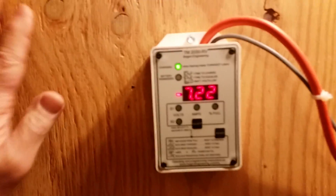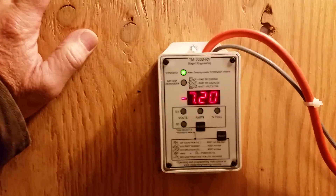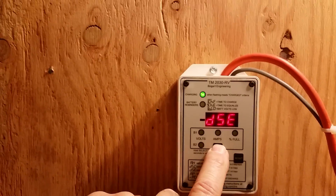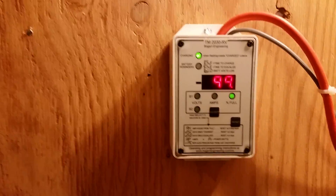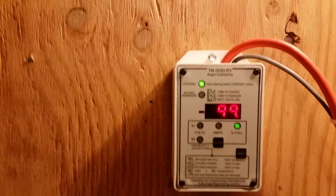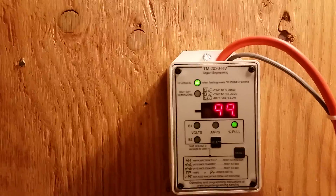So what I've been doing on cloudy days is turning the solar charge controller off, so I don't have this artificial voltage going to that shunt — and it stays in absorb mode longer. Let me show you how much longer. According to my battery monitor I am down minus 7.2 amp hours, so I'm getting very close and should still be in absorb mode. Now let's look and see where the batteries actually are. I'm at 99%, so the fact that the inverter charger is still charging the batteries is really good news.